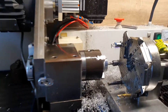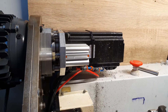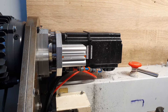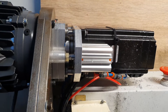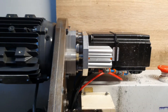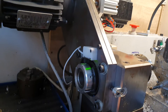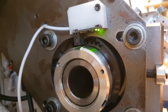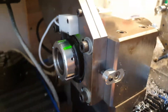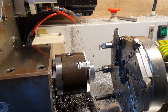Hello, I would like to present how I'm making threads on my little lathe using the 12 Nm hybrid stepper motor, which is sort of a stepper motor, sort of a servo motor. It is on the clutch that is connecting directly to the main motor through a gear ratio of 2 to 1, driving the spindle. It is homing first, so in case I need to start again, I can do so.